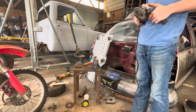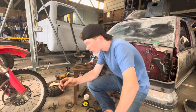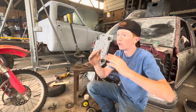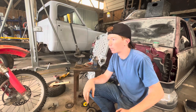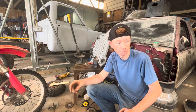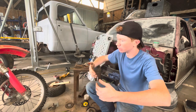We welded a new wheel arch in it, and when you're welding a piece of metal, it expands. When it's liquid, it's expanding as much as the metal can. And when it cools, it shrinks. And when it cooled, it pulled in like this on the panel we welded in. So now the panel goes flat, and it dips and comes back up about a half an inch in some spots. We got all the body lines lined up, but it was terrible on the bottom.